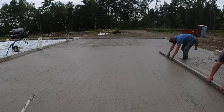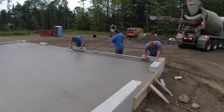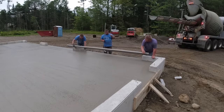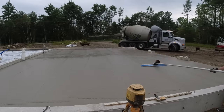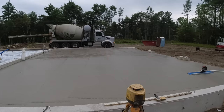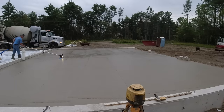For these floors right here, it's a pretty basic cost or pricing for us. I've figured it out over the years to estimate just by the square foot and be able to make a profit — obviously staying in business for 42 years. Four inches of concrete will do about 80 square feet. Let's say the concrete costs $200 a yard — that'll be different wherever you are — but that mix will go 80 square feet. So $200 divided by 80 comes out to $2.50 per square foot just to buy the concrete.